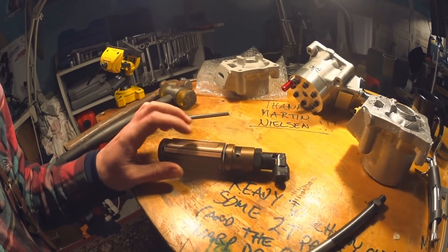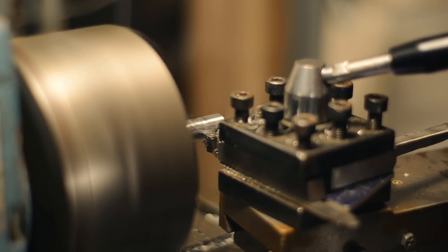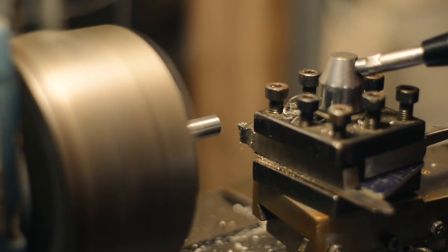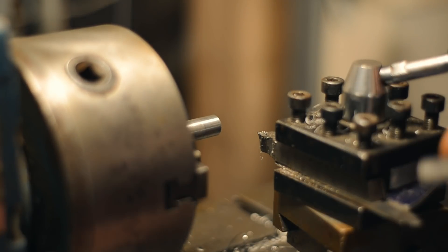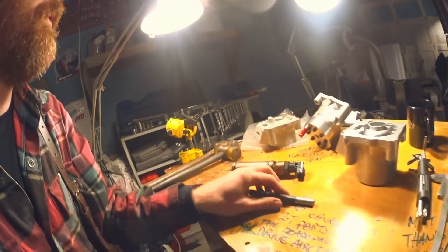The plan is to machine the faces and send it off to have it bored and plated by them, to spec. That means we can test without worrying about the plating being bad or not professionally done. This honing tool is the V3 version — fits 38 to 50-something millimeter bores. It came with a 14mm shaft and I turned it down to 12mm to fit my drill, because my drill chuck only goes up to 13mm.